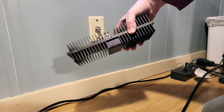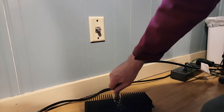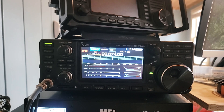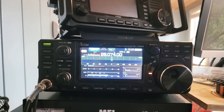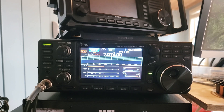What I've got is the Cellwave dummy load and an N-type to SO-239 adapter. Let's plug in the dummy load and get over to the radio and test it out. The tuner was stuck — the tuner down here just out of frame was stuck. We are good on 10 meters. Let's switch to another band just because we can, and we are good on another band. So it is the coax between the antenna and the house. That sucks.